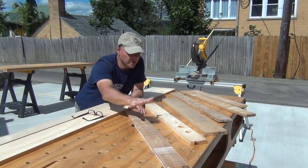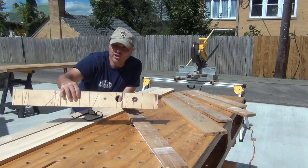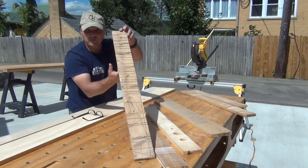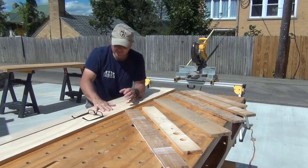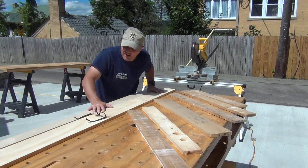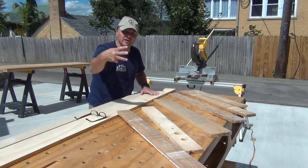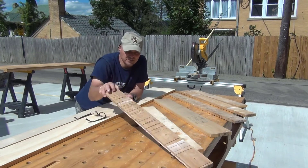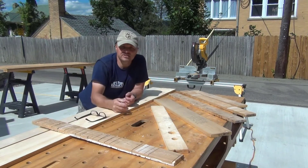Sacrificial strips really save the table and I can use them for a lot of things, like hole saw guides when I need to change the size of a hole saw. And this one got used as a list at one point. These are pretty chewed up — I have been using these for a while now. These are not the original; they are just the next ones. I have two long sacrificial strips that I made during that video and these get stored on the trailer. I haven't used them yet because I forget they're there, but they are as long as the bench as opposed to the width of the bench. So they would be a little more convenient, but I do need a third one — otherwise material could sag in the middle and I could potentially cut my bench. I would need a third long sacrificial strip; otherwise I use these crossways and have five or six of them that will do the job.